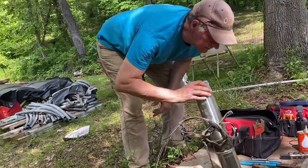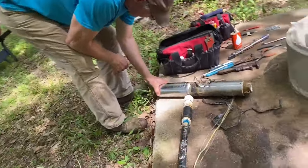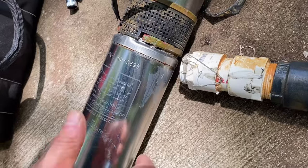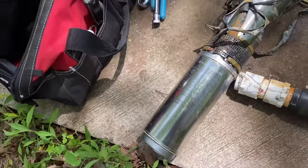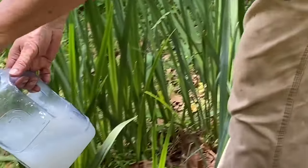His pump was a stainless steel pump — a little better quality than the one that came out — and it had a built-in check valve. He had a stainless steel adapter that went from the pump straight to the black poly pipe, so we didn't have to have any of the plastic PVC adapters. We got the new pump in and everything's buttoned back up — all the electricity turned back on, all connections made, and the water is now flowing.